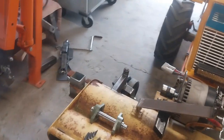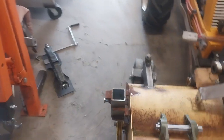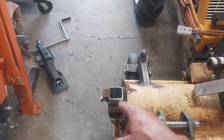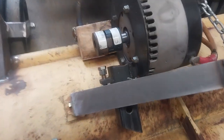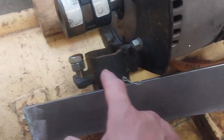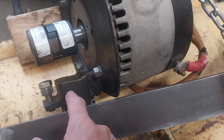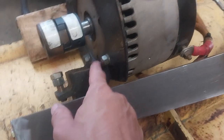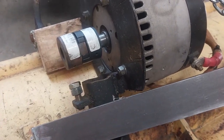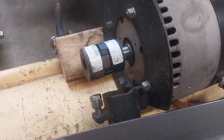The next thing that I need to deal with — and I may investigate some other solutions — is that whenever the motor's on here doing its thing, it vibrates quite a lot. The reason being: you look here where my little receiver hitch is, that's my motor plate. That's the only connection between this receiver hitch and that motor — just this little one-inch wide piece of metal that's welded in there. And that's not really very good.